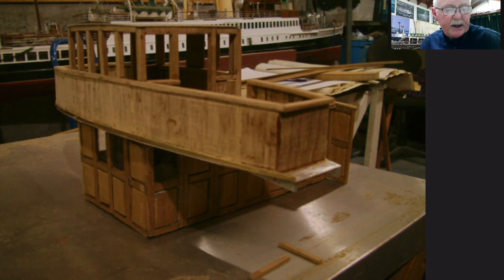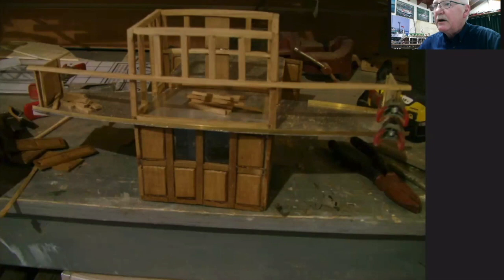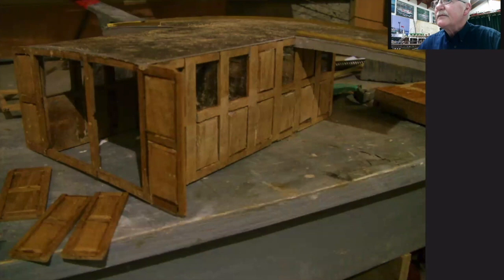To explore the adherence of aluminium to epoxy, I began work on the bridge, which is here, by cutting teak panels and using 1 mil aluminium for the deck. Strips had a small gap left between them for the deck. And I filled that with a mixture of epoxy and black dye and then power sanded. It stuck okay. So the wheelhouse was the first bit.